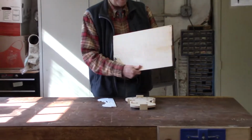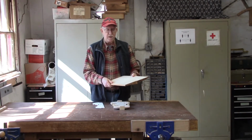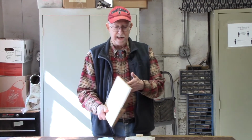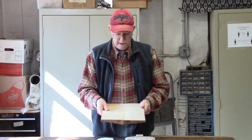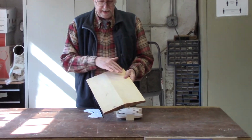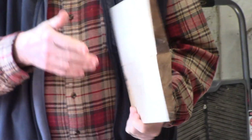Yesterday, I glued up what will be the back of the violin. I glued this with hot hide melt glue, which I'd never used before. I bought these pieces from a violin maker in South St. Louis. Milled them up a little bit, got the joint to fit, put the glue on it. So the next step is on the front to smooth that out and get in the curvature that's intended, and put the pattern on it and cut out the shape.